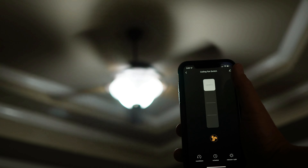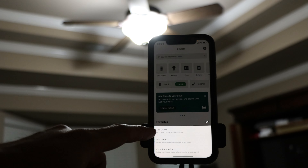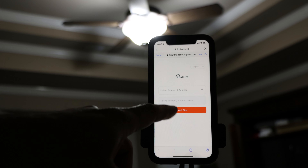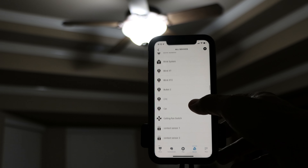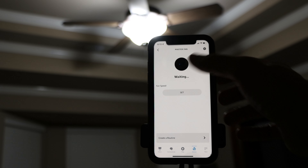As I said, more than likely I'm not going to use the Treat Life app, so let's set this up with Amazon Alexa. Open up the Alexa app, click devices, click the plus sign on the upper right corner, click add device, and search for Treat Life. Click next, click enable to use, and we need to associate my Treat Life account. Log in using your Treat Life credentials and click authorize, then wait until it is successfully linked. Click close, then click discover devices. Choose your switch to set up — it's going to be in our bedroom group. I'll change the name of the switch: in the devices list, click on the switch, gear icon to go to settings, and edit name. I'll rename this 'master fan.'